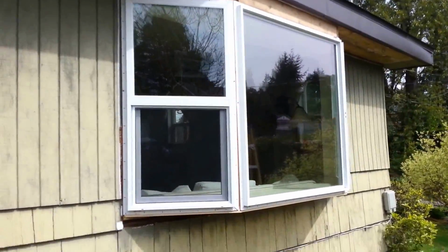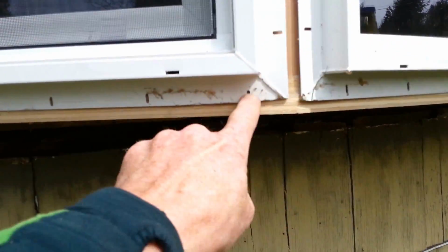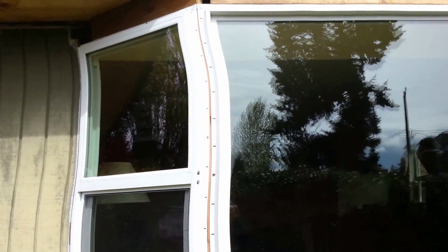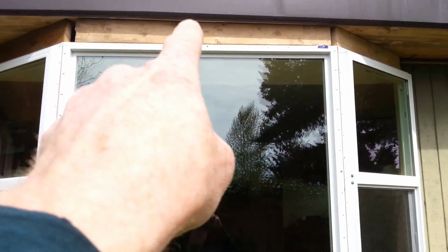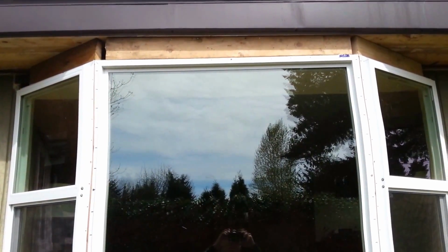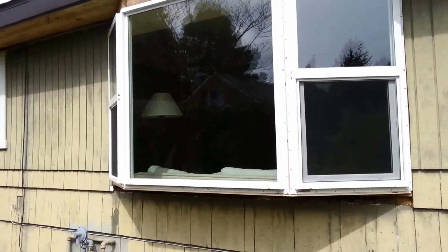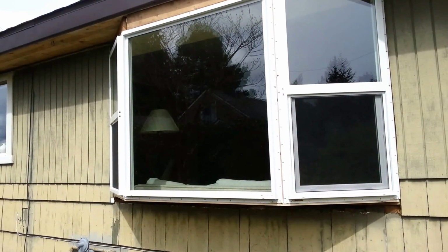Okay, here it is. Like I say, I like that margin. I've got my double plywood here, and these are hitting real nicely. The integrity of this whole assembly comes from the top, where I've nailed those blocks into the soffit, and then the top plywood is nailed to those blocks also. You saw that part. What I'm going to do is screw the windows in fully.